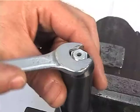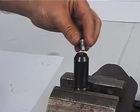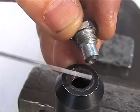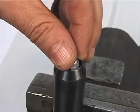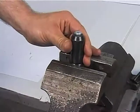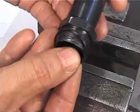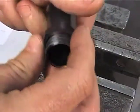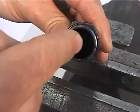Fasten the head carrying nozzle in the vise, disassemble the nozzle and check the thread of both. Check the wear of the O-ring, figure 3, then mount it on the head carrying and verify that the inside of this latter is in good condition. If necessary, clean it by a compressed air jet.